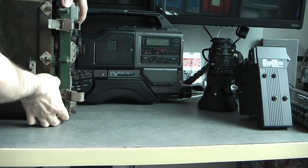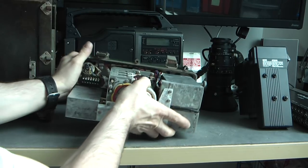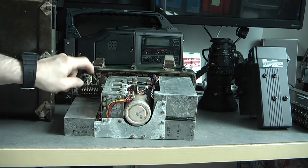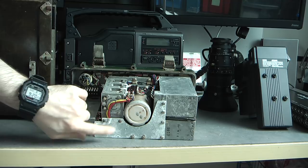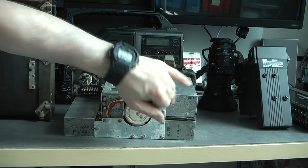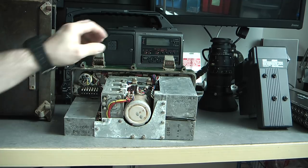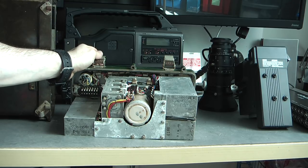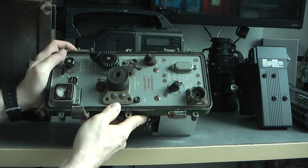You can never know what you will find in these old military radios — sometimes they are in good condition. Mine was actually a lot better than this one. But here you can see very oxidized parts, very rusty. All the connectors, everything — there is white powder everywhere. So I believe I will scrap it. It is a little bit sad, but once you have white oxidation like this on aluminum it is almost impossible to stop and everything is in very bad status. I will probably save interesting parts from it, and hopefully the electronics inside will not be too bad. I can save some parts from the front panel, the buttons, and so on.